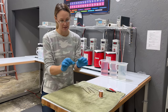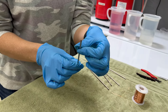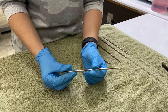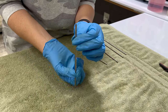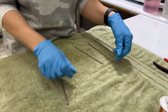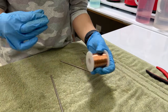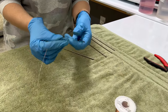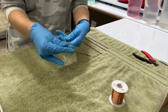The size of our piece is actually a cylinder. On this particular piece, the surface area inside of the tube does not have to be plated. Here's the part we're going to be plating — it's a tube, again the tungsten copper mix. The tricky part is figuring out how we're going to rack them. One of the easiest things I like to do is have some copper wire on hand. Copper is a great conductor and it comes in all sorts of thicknesses. This particular one is thin enough but stiff enough that it will easily pull through the center of my tube.